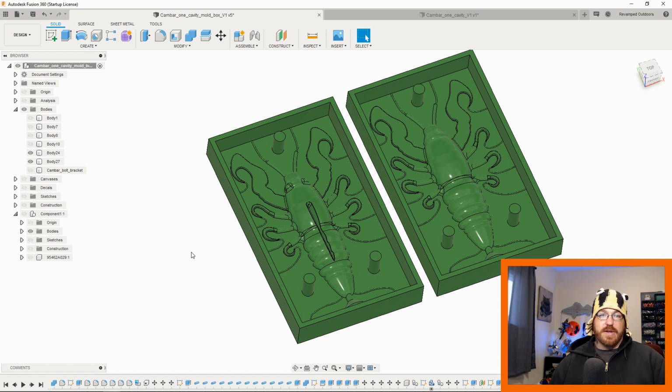All right, so now that we have the mold boxes done, I've been printing these on the ANET A8 in 0.08 layer height. That's a pretty high resolution, low layer height. It creates really nice rounded bodies instead of having real thick layer lines. If you are new to 3D printing, you've been seeing the ANET A8 in the space. I really like the machine, but it's taken me 1.5 years to upgrade it. Just be aware that the ANET, when it comes in a stock configuration, needs a firmware upgrade at minimum, and it needs a power supply upgrade moderately.